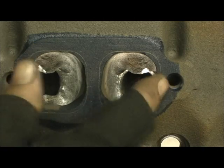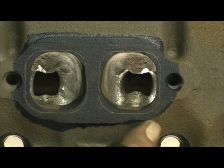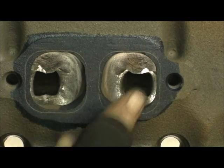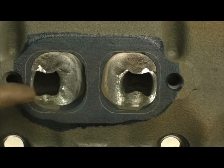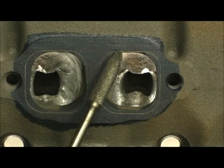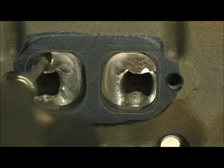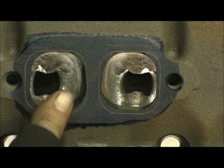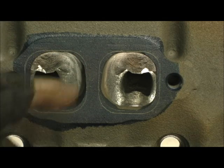Look at how much I've got to move side to side and straighten this out. Notice I have a line scribed on the bottom, but you do not remove material away from the bottom of the runner — you never do this. I'll come in and make my slice sideways. We're going to set the cloverleaf — the width and the top width — and that's it. I never grind on the bottom. If it didn't cost what it does, I'd fill meat up to about here — weld material and fill that up — but it's just not applicable in this situation.